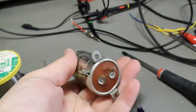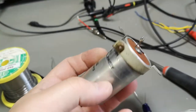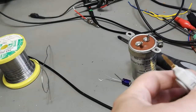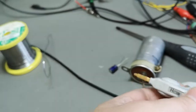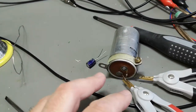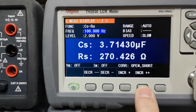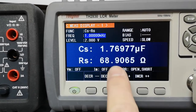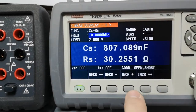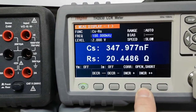And the thing is, it's really, really lightweight. It's actually a lot of fun to open those and find out how they made them. When I was measuring, well, we can actually do this, then I will show you guys what is happening with old time capacitors like this. They were really designed for super low frequencies. So now let's look at what happens when you change the frequency. So that is 100 hertz. Let's go to 1 kilohertz and see, the capacity goes away, right? And it's because of the way that it's made. See, 100 kilohertz, there's like nothing left.